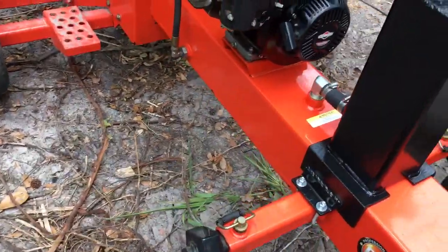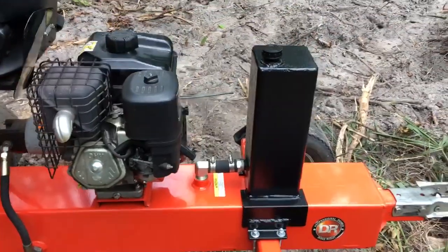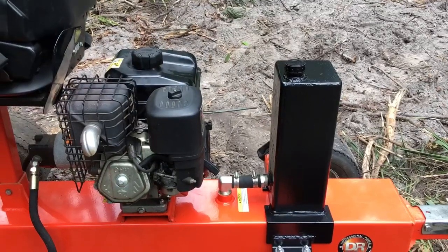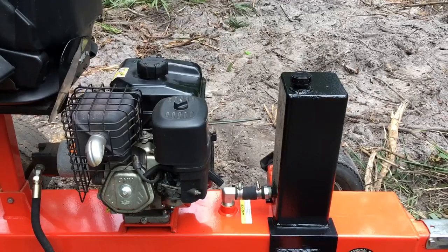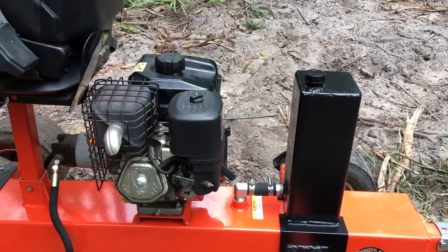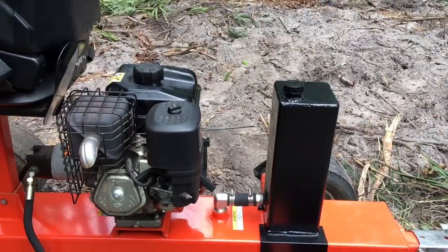Once I did that, as I moved around, I had a problem with oil coming out the vent. So I built what I'm going to call a burp tank. I keep just a small amount of oil so that the outlet or inlet to the tank is never below the level. It keeps the lower tank completely full of oil, but no oil ever exits out the vent.